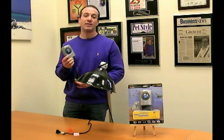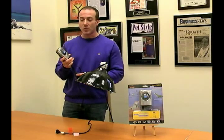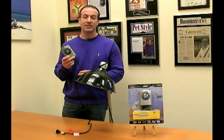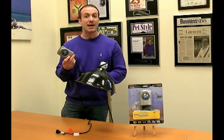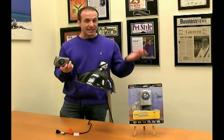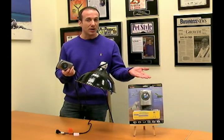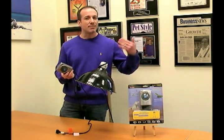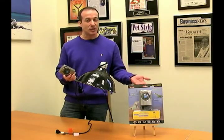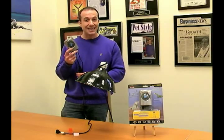It is one of the most accurate and reliable thermostats on the market. Short of being a proportional thermostat, it is an on-off thermostat. It works like the temperature controller in your house. You set the temperature, it hits the temperature you set it for, shuts off, drops down a few degrees, and comes back on. Think of the one you use in your house and you'll have a good idea of how this works.